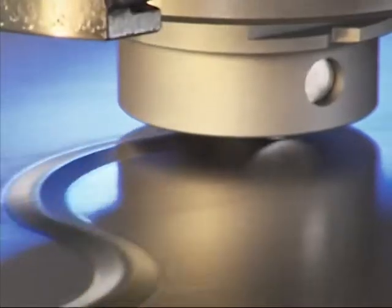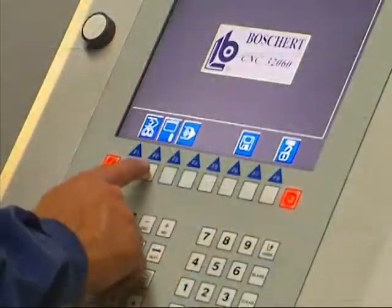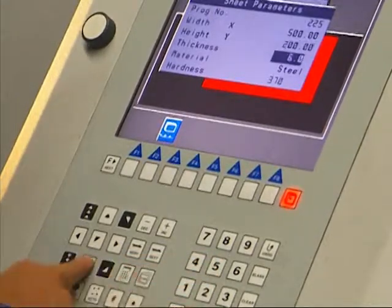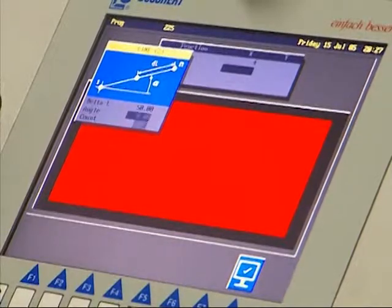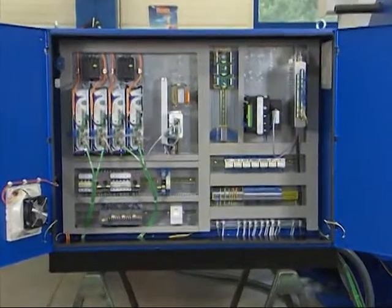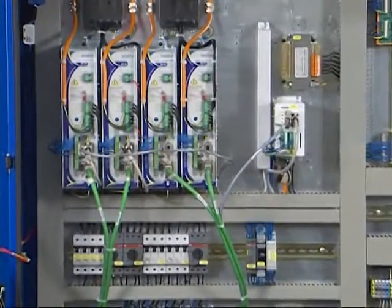With all compact series, a roller tool can be used. The Boschert software allows simple and fast programming with dialog support: enter sheet metal parameters, choice of tools, choice of functions, and programming of the start position. Now the program can be activated or further parts may be programmed. The electrical cabinet is easily accessible, and the well-placed components ensure simple error analysis and fast correction.